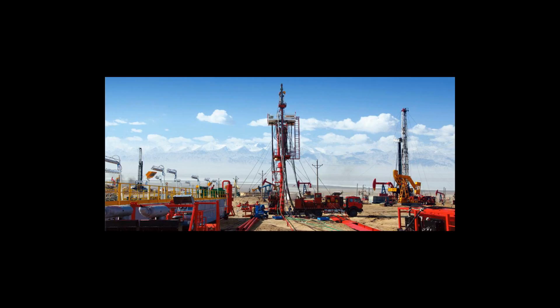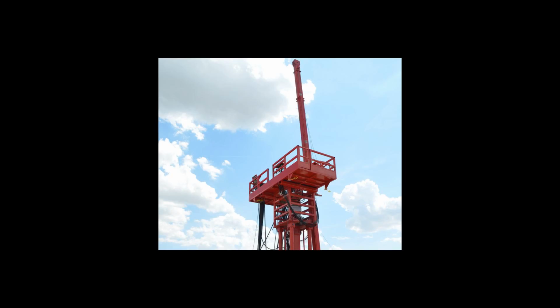Risks. The more complex method of pressure control, as compared to coiled tubing and wireline, naturally invites more opportunity for things to go wrong. One such peril was seen in June 2007 on the Shearwater platform. Snubbing was being used to clean out large pebbles, which had entered the well through a collapsed liner.